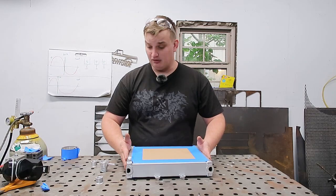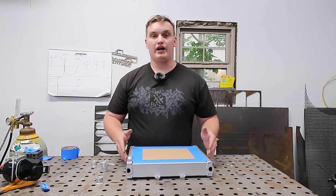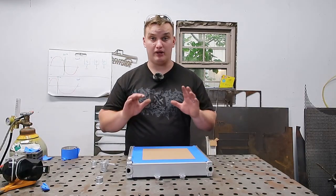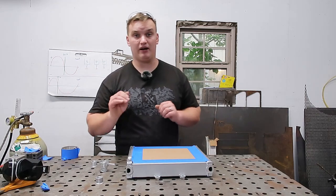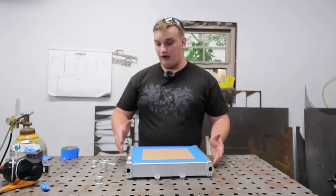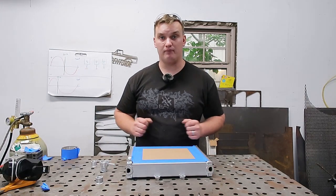So one thing I notice is that, unfortunately, even though this thing is aluminum, they thought that they needed to paint it silver. So we need to clean this paint off of it before we start grinding on it, so that we don't massage all that paint and debris into the aluminum, so that we got some good clean substrate to weld back onto. So I'm gonna take some solvent or acetone here, wipe this paint off, grind these smooth, and we'll make some caps and weld them in.